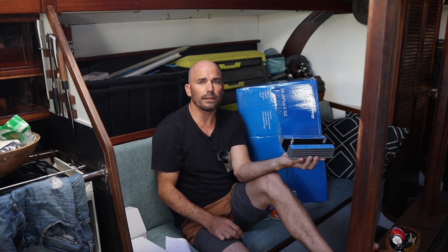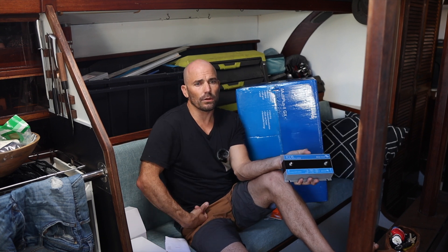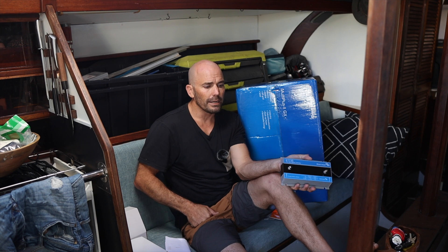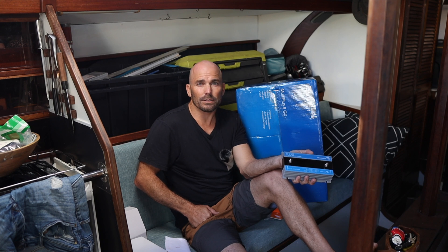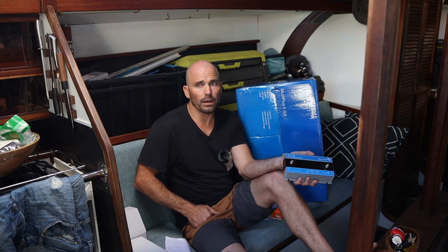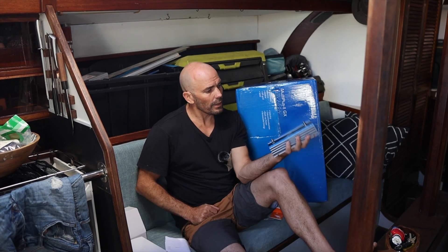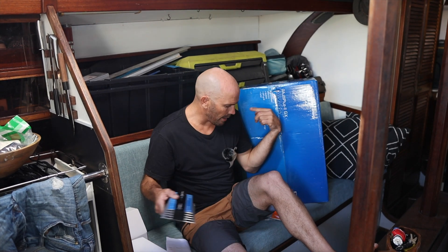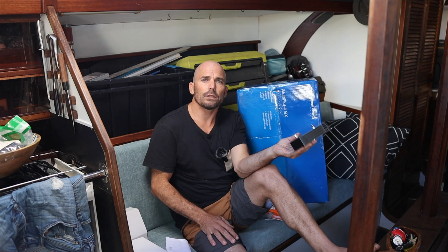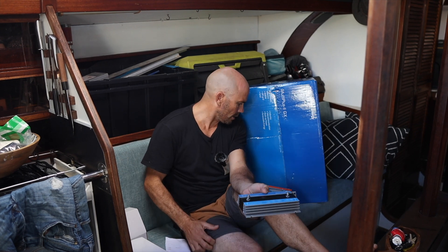This is the reason why I haven't been connected to shore power — I've been worried that being connected for such a long time would speed up the corrosion process underneath the waterline. So I've basically just been living off solar panels, and every now and then when it's been raining for three days straight I'll plug in to shore power, juice up the batteries, and take it back out. What I hope to do is install this galvanic isolator first, then the Multiplus with these data cables, and hopefully just be plugged into shore power going forward.